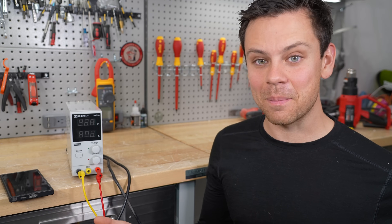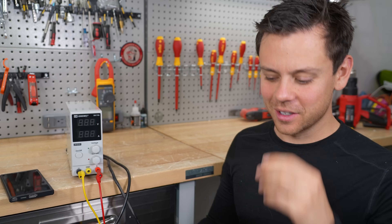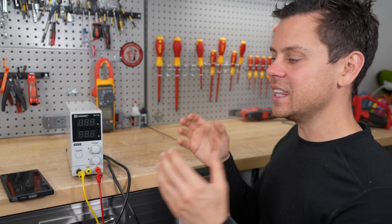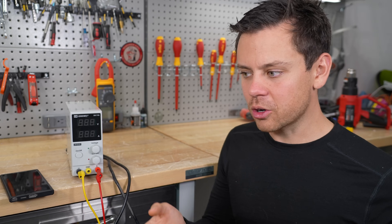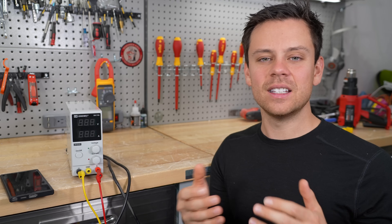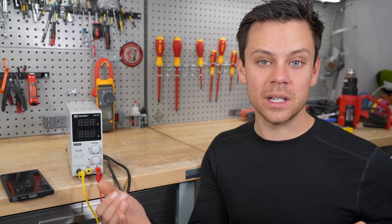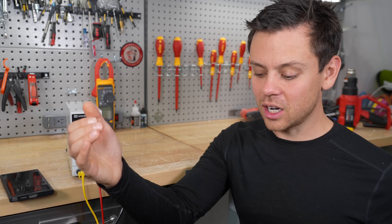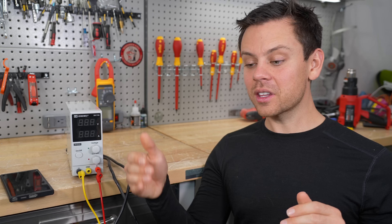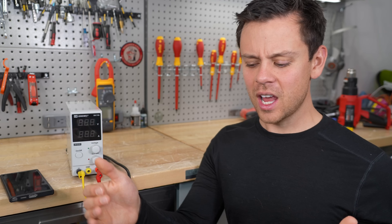Personally, because the only way I've actually killed batteries is from over-discharging them from storage, I leave them at 100%. I capacity test them and do all sorts of things — and guess what, the degradation isn't that bad. It's over 120 degrees Fahrenheit outside here, I leave them in a big pile, they get rained on during winter, I keep them at 100% state of charge, and the degradation is not that bad. Even in this desert climate, with my gate opener battery held at 100% state of charge, we only recorded 4% degradation in the worst climate possible. Don't be scared of it. The only way I actually see people killing these is by neglecting them and not charging them enough. So my recommendation still stands: charge to 100%, don't be scared to discharge to 0%. And if you're storing them, you need to check on them. Also, don't overthink it — the BMS does everything. As long as you keep it charged, it will do everything for you.